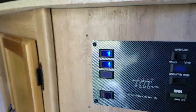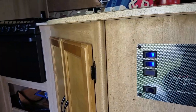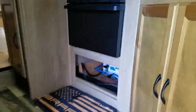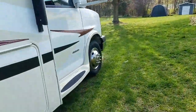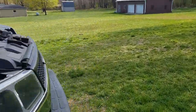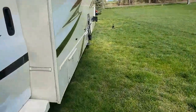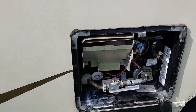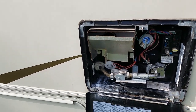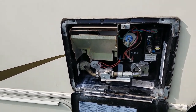Okay, so I've got the water pump on, the water heater is on, and I'm going to go outside and show you guys the water heater. We've put three gallons of vinegar and three gallons of just regular water in the hot water heater. We're going to let it sit for approximately six hours so it can penetrate and break down any of the calcium deposits.